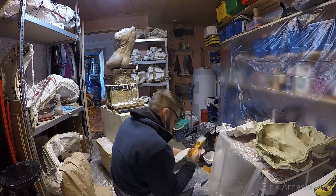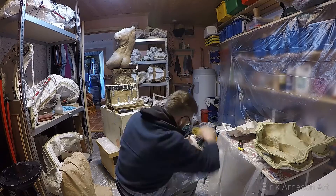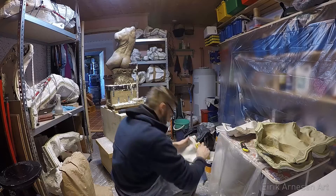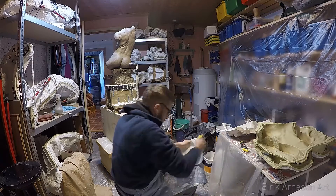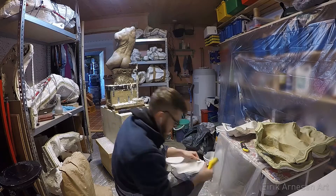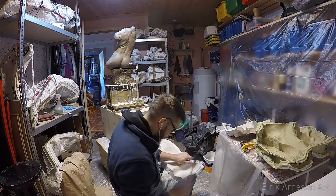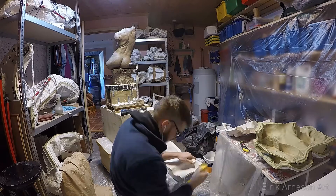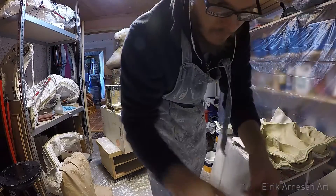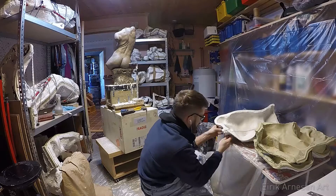I'm not going to handle this mold much since it's going off to a foundry, but it's nice to clean it up. I'm using a rasp and a small knife to clean up the edge of the mold so the bronze caster doesn't cut himself — I cut myself pretty badly on this mold. This material is a lot harder than plaster; it's almost porcelain hard and very tough. Watch out when you do this — maybe wear some gloves.